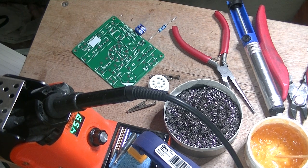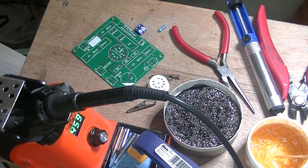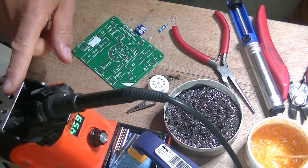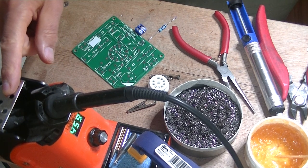First, caution everyone: electronics and tube amplifiers can have very high voltages present, which can be lethal. Exercise extreme caution when working around them. Always consult a professional technician when in doubt. Soldering irons are a fire and burn hazard, so be very careful using them. I highly recommend you find a temperature-controlled soldering station with an automatic time-off or shutdown feature.